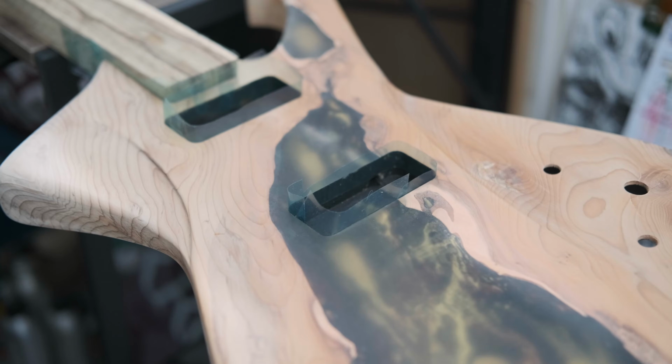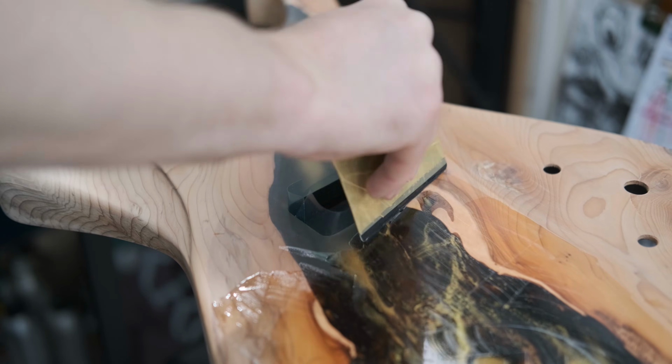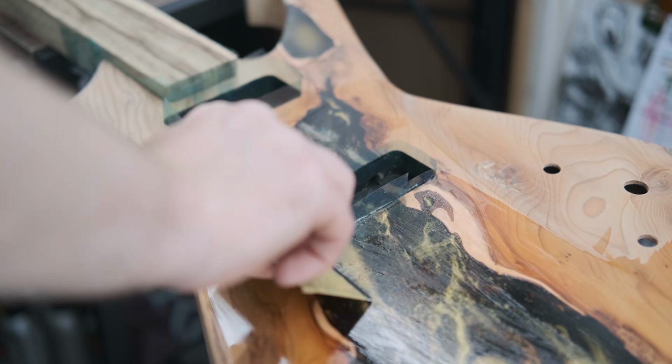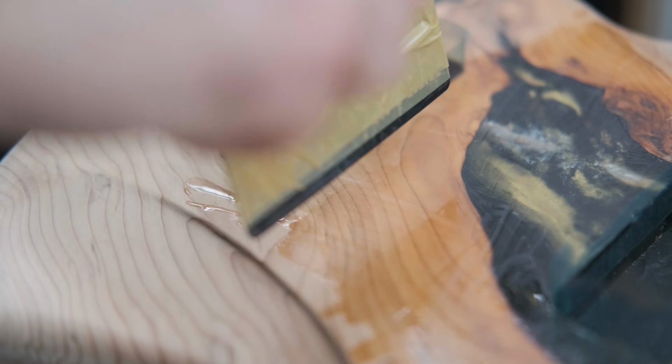And now onto the bar top epoxy finish. In an ideal world, I would have used the penetrating oil as it protects deep inside the wood whilst bringing out its natural vibrancy. So here I'm just using a card to wipe on the epoxy as thin as possible. It will take some time and patience slowly building up the layers, but the patience will pay dividends later on when it comes to the sanding.